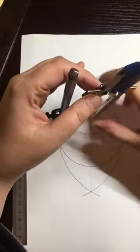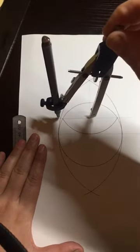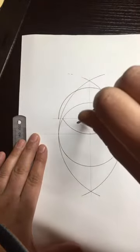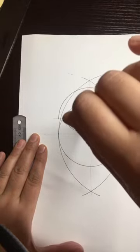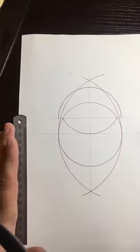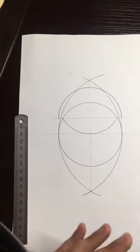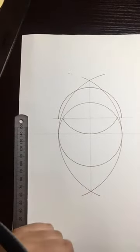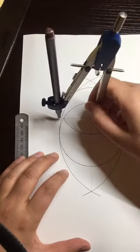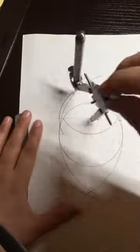And I'm just going to show you two elements. So the first is I start on the springing line, and then I do a semicircle all the way around. And I stop, okay? So this line here is the arch, and I could basically come down, across, and up, and that's your typical standard semicircular arch. But I think this is more common in Islamic lands: instead of staying at the springing line, I go back to my original horizon, so that it curves back.